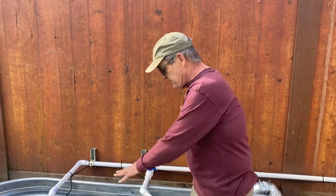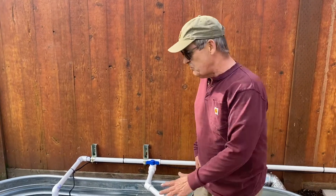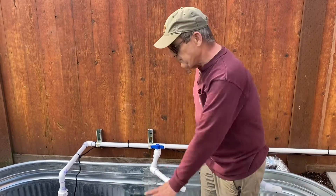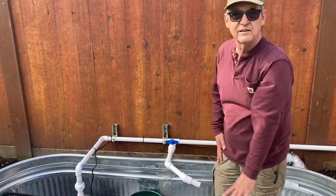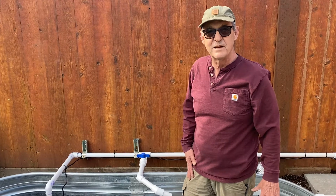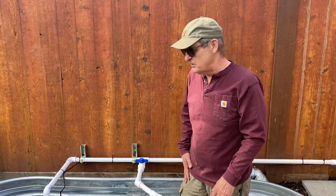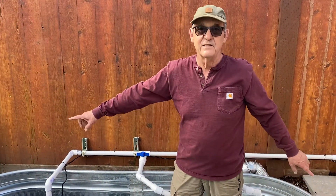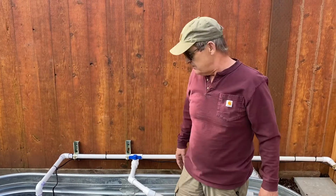For the tip of the day today, it's kind of a double tip. Tip one: if you're putting in a pond or tank, make absolutely sure that you've done everything in your power to get it level — as close as you can. Put sand in, pound it down, pay more attention to level than you think you ought to. Just a little off level on eight feet and you're going to have water the wrong way.